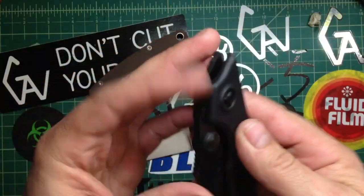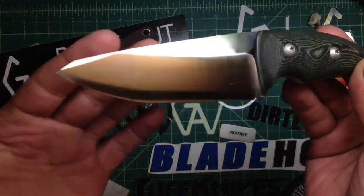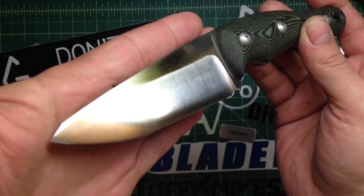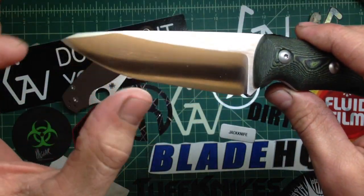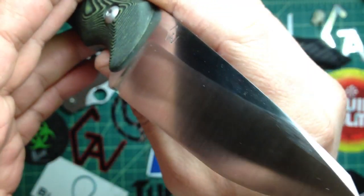I'm not sure about the pricing on this one — I ground it today and finished it, just have to make the sheath tomorrow. It's kind of a new design — went to the drop kind of like the tough nose Raptor but I changed the blade shape a little bit. I did a straight edge and then the original belly, so it has almost like a Japanese tanto style because it's straight and then the angle changes completely. It actually looks highly polished but it isn't — just a nice, uniform satin finish, shiny but with nice even finish across the flats.